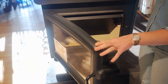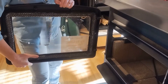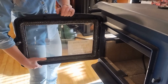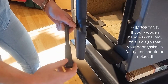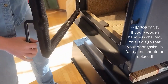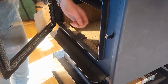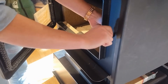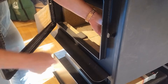Most Blaze King doors come off easily by just wiggling up and pulling them off. This door handle is also often replaceable — depending on your model, it should screw on and screw off. The door catch is also often replaceable and even adjustable if you need to make it tighter. You would loosen this nut, loosen the nut that's inside of the stove, tighten the catch by screwing it in, and then tighten those lock nuts again.